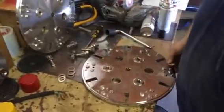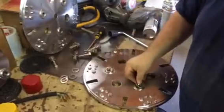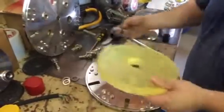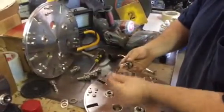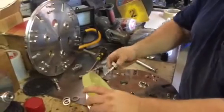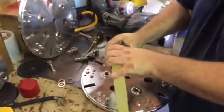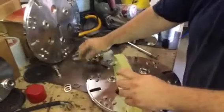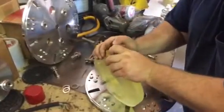If you're doing a 3520, just put the round side up and put three of them around. Then take your bolts and another washer and put the flat side towards the head with the round side towards the urethane. Push them through the urethane until they're flush. Every other one you're going to put a bolt with a washer on them.